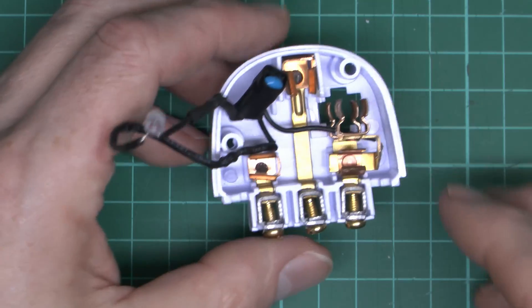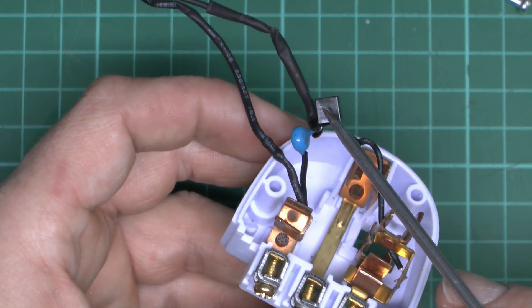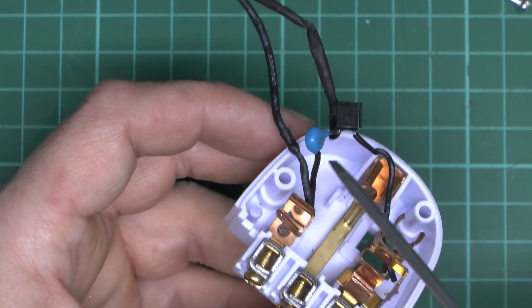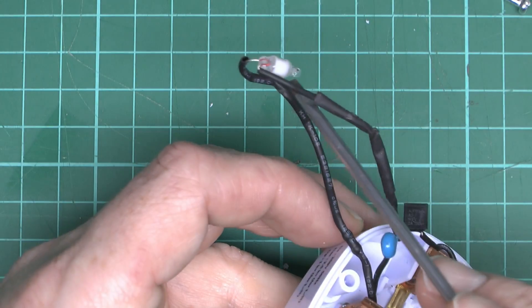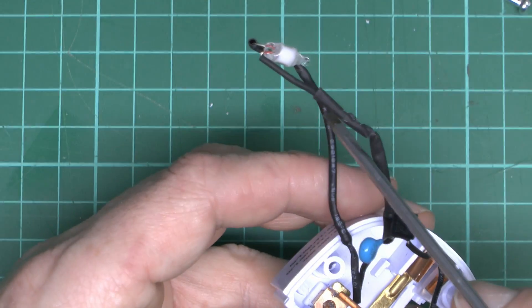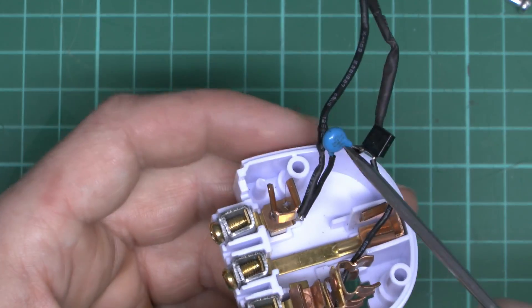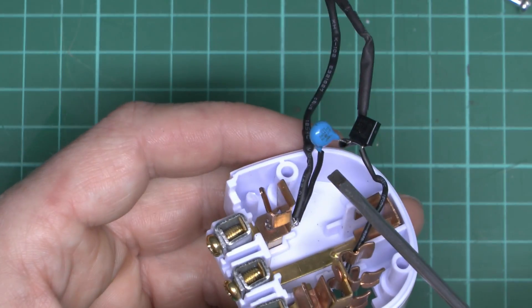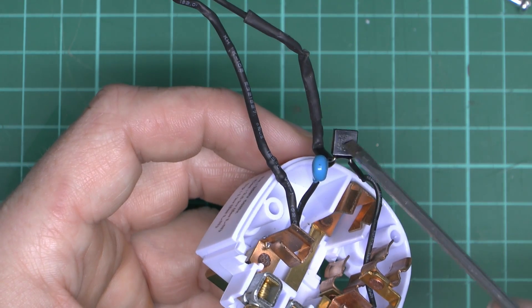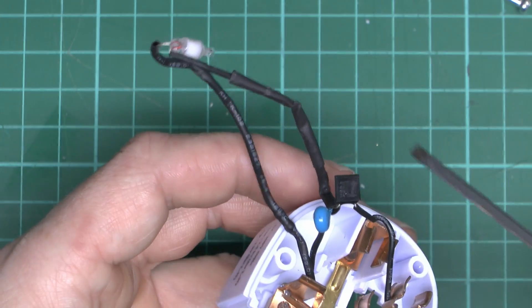Let's see how that is actually wired. The line comes in here, goes across this little black device, and then out of that one lead goes via the very, very small metal oxide varistor to the neutral. That same wire also goes over to the neon indicator via a little resistor, and then comes back to the neutral. So basically a power-on indicator and an extremely minute MOV. So yes it does have surge protection, but it's incredibly small — not going to do a whole lot in the case of anything substantial. This black device is probably a fuse of some kind — if it fails, the green indicator would no longer illuminate, indicating that the surge protection has either failed or whatever.